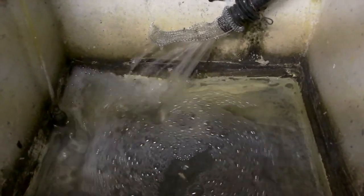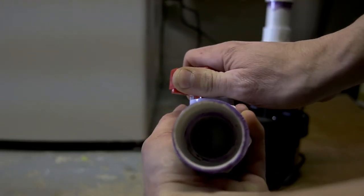Now the ball valve is really going to control the rate of flow of water leaving the pump. You want to match the flow of water coming into the sink to the water flowing out so that the pump isn't cycling like crazy — going on and off, on and off. You want the water to come into the sink, the pump to turn on, shoot the water out at a consistent rate so the sink level drops and once it gets down to the pump, the pump shuts off. It just runs once — that's it. It's going to save the life of your pump.